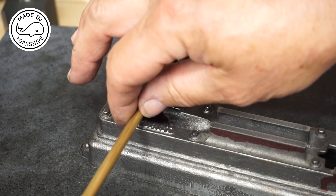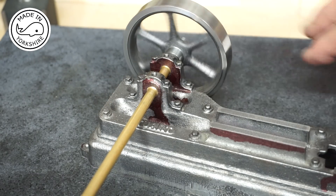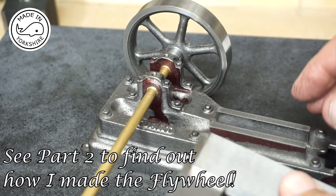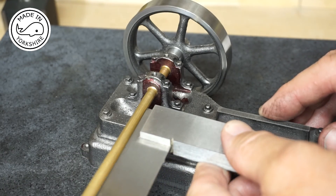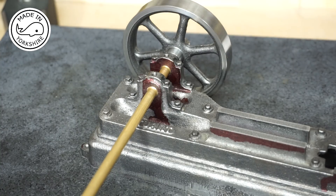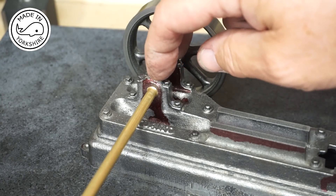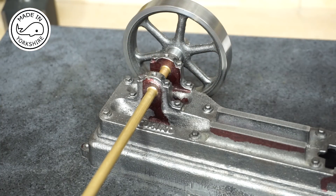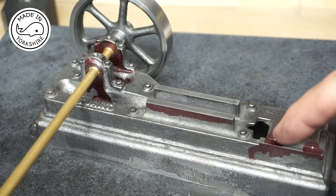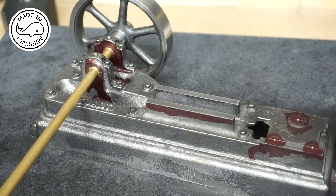This little brass test rod fits perfectly. The little flywheel turns very nicely. I put a set square along these guides and that's spot on 90 degrees, so I can't complain about that. All I need to do now to finish off is drill some holes here for the oilers - I'll do that at some future point. There are holes to secure it to a wooden base, which I'll do off camera, and I'll also drill the holes to secure the cylinder and underneath I'll just flatten that area using an end mill.